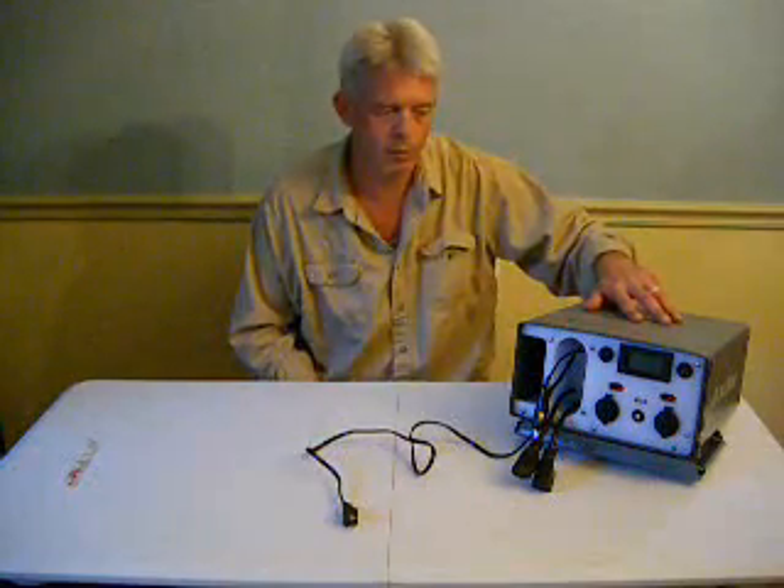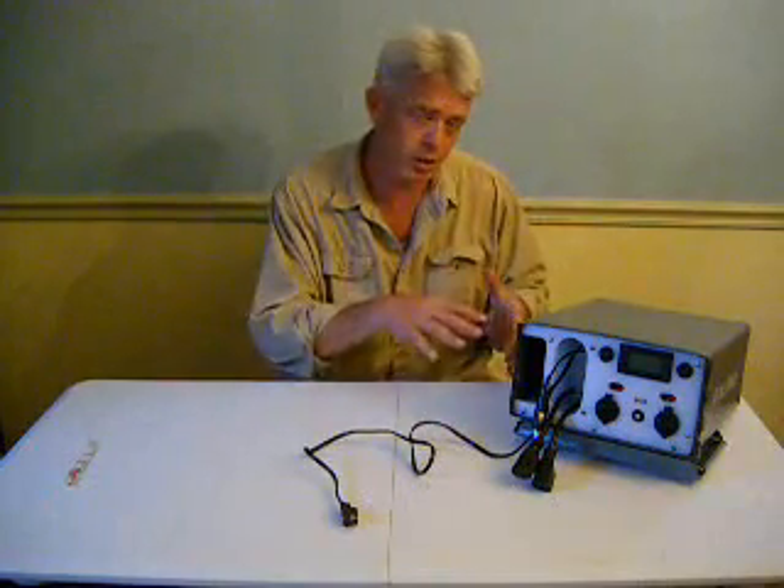The charger that's built into the juice box is a fully automatic 3-amp charger. The automatic part is an important point, because what that means is you can plug the system into the wall and forget about it. Less expensive chargers simply don't do that. You may have devices at home that tell you to plug it in for a certain number of hours and then unplug it — don't leave it unattended. That type of charger delivers power to the batteries but has no feedback mechanism to know the state of charge in the batteries.